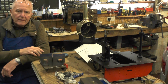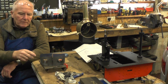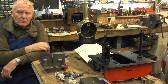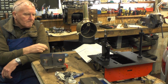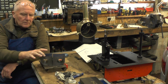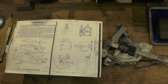Hey up everybody. I'm on the next part of my cylinder videos. In the last part I put this radius on, and the part before that I bored them out and made them all to size. In this part I want to mark out the positions for the ports and get them milled in, and there's the exhaust port to put in and the compound angle for the steam passageways to each end of the bore. I'll make a start and we'll crack on.